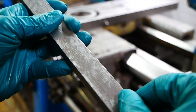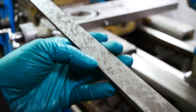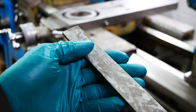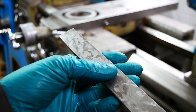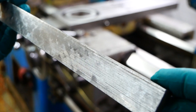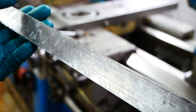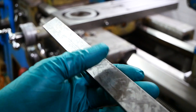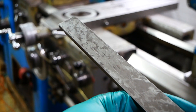There were quite some deep scratches on this long gib, so I took one pass with hand scraping just to remove the highest points. Because I think it was worn down quite a lot, it should fit and just give a little bit better bearing surface. With these scraping marks I can check in a month or so where it was worn down and what the condition of the gib is. So let's check it out and put it back together.